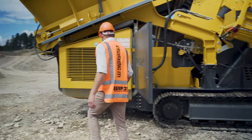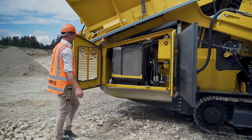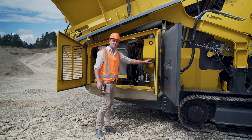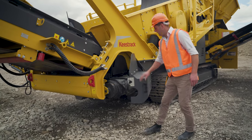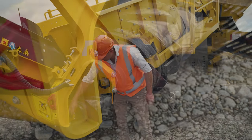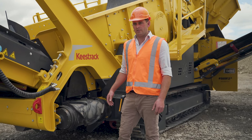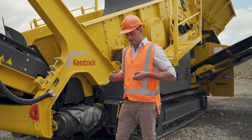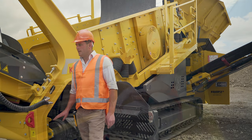Accessibility is a key feature — as you can see, a lot of the doors open up with nice heavy-duty latching hardware. Right through here we've got our fuel tank, which is stainless steel, so anyone using biofuels has no risk of rust or contamination. A newer feature is that many of the drums are maintenance-free — the sealed bearing is inside the drum itself, the shaft stays still, which minimizes requirements for greasing, eliminates broken grease lines, and reduces dust build-up on the bearings, greatly extending their service life.